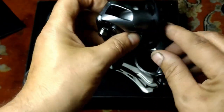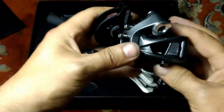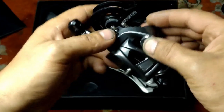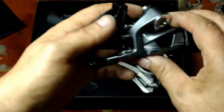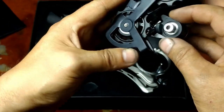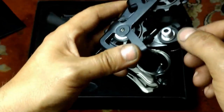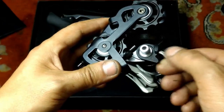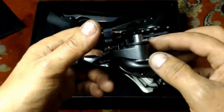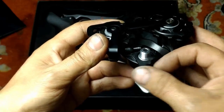The upper pivot's in line, upper jockey wheel's in line with the pivot. There's no spring in the upper knuckle there. It touches it — this is exactly like SRAM except this is the disappointing part: this is in plastic. So it's definitely a potential weak spot. Might even be able to use a metal one from a SRAM derailleur.